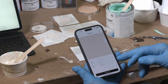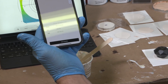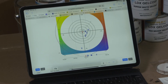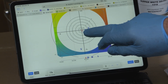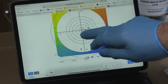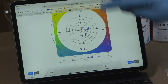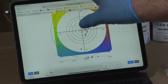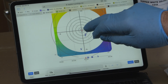The numbers are 90.237, 2.78, 8.08. We've entered the numbers in and you can see now M6 is just touching on the center line and it's almost within the 1, which is considered an acceptable match. So let's just add a touch more green to it. You can see where we've gone from M5, which was high, to a little bit of green. Adding more will probably drop its luminance down ever so slightly.